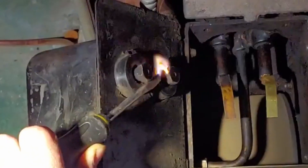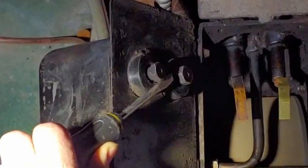The furnace opens up the main burner and sprays gas through a high-voltage arc across those points. Sometimes it sounds like a click, click, click; sometimes it's more of a bzz. A fuel oil furnace has a serious spark coming from a really high-voltage transformer, but I would consider that also a direct spark ignition.